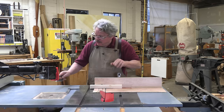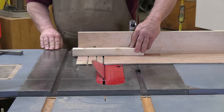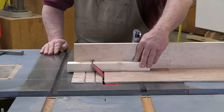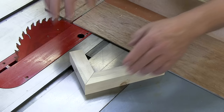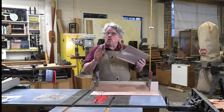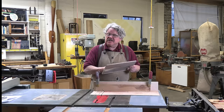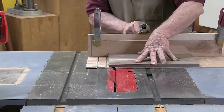The miter is a simple joint, but it can be a little tricky to set up. What I do is first bevel the blade to what I hope is 45 degrees, then make a single cut in a scrap. I take the mitered scrap, reverse one of the parts, put the two together to form a corner, and test it with a square. The advantage of this method is that if the blade angle is off, the discrepancy is magnified by a factor of two, making it much easier to catch and correct. One of the most common problems when cutting miters is that the spinning blade wants to drag the workpiece sideways. So I build an L-shaped fence extension out of plywood scraps to cradle the work during the cut, and stick a piece of 100-grit sandpaper to the base ahead of the kerf — this is enough to keep the workpiece from shifting.